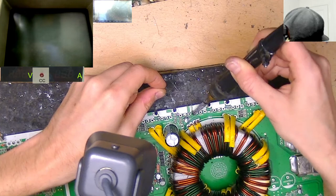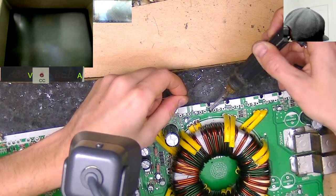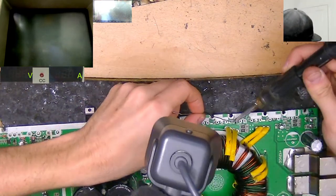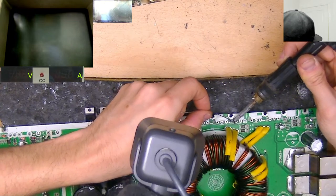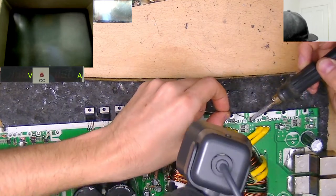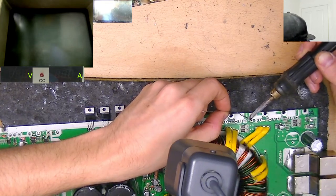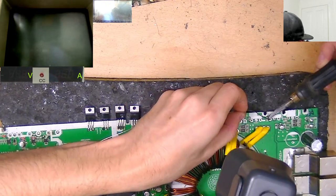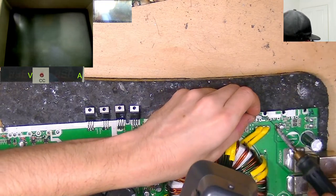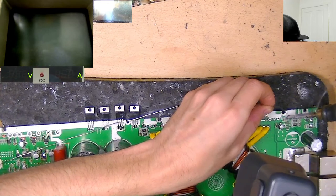And stupidly, I forgot how awesome they were. And I had a bunch of spares of the 1404s and I fitted them to a Korean half bridge. So I know which Korean half bridge they're fitted to. They're fitted to an LW Audio 4500. So that amplifier, provided there's headroom in the transformer, would be good for like 0.5 all day long. I think I upgraded the output FETs as well. Yeah, I did. I upgraded the output FETs in that one as well. It's just because I had them laying around. So it was for a mate and I had parts in stock laying around that were just the right number of FETs for that amp. And I was like, oh, the chances of me being able to use these for something else that's just the exact right number with the right specs is kind of low. So I thought, I might as well use them in this LW. And my guy got an upgrade as a result.